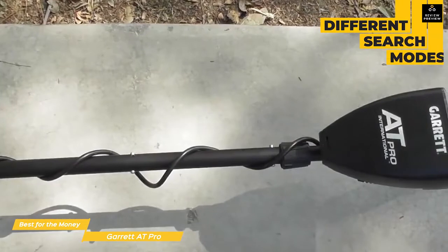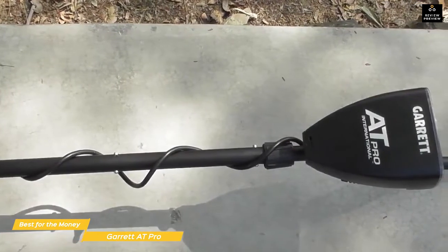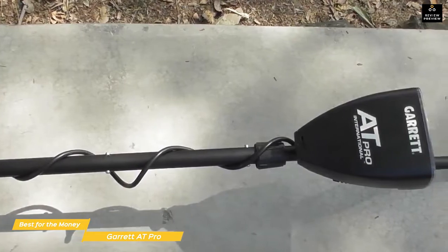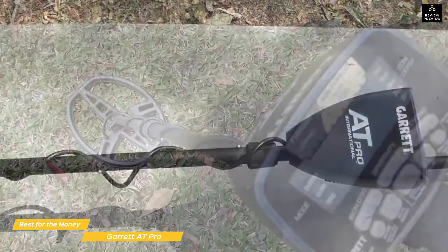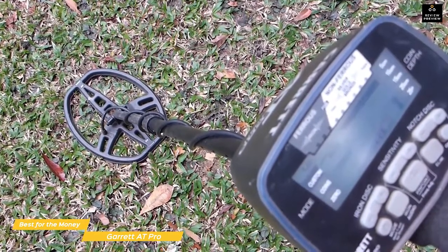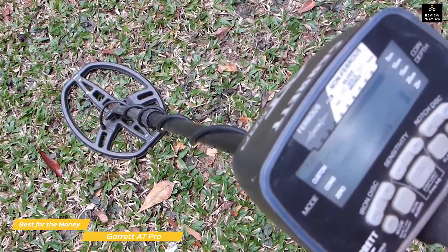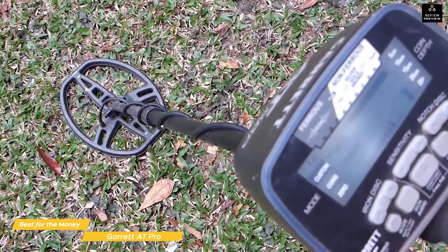Standard preset modes are good for both mid-level and seasoned detectorists for their quick, accurate tuning and feature a constant binary audio tone to indicate the target, or its absence. The standard modes are also great for learning to work with the AT Pro. The Pro modes use proportional audio and tone roll audio features, providing more audible tones and variations of sound for quicker interpretation of the target.